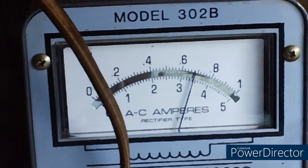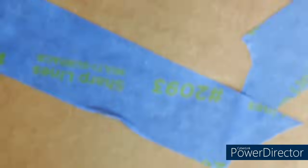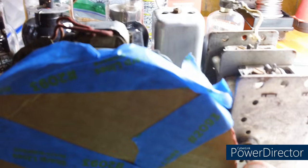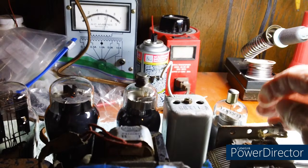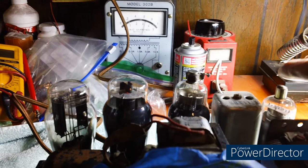Alright, you should be playing right now anyway, but we're getting nothing. Let me hook up the antenna. Just a little bit of static out of the speaker. Probably caused by one of the tubes, I don't know. Probably a tube. Well, we're getting nothing. I have the antenna hooked up. We're getting zip. Not even a hint of a station, which really irks me. Let's take this off the top of the 6A7, which is the first tube. See, it shows it all the way through. So the problem is somewhere in here, or this.